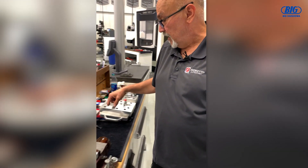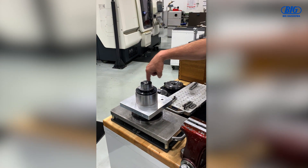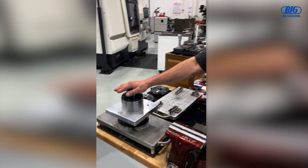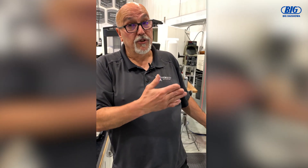A lot of times I use the coordinate systems inside the pallets. My XY coordinate system is already in my G57. If my G54 is the vise and there's a particular jaw set up on there, I just switch over to the G54. A lot of times I don't even have to touch off just to change my work coordinates, because it's already in there.